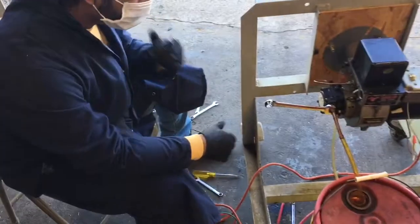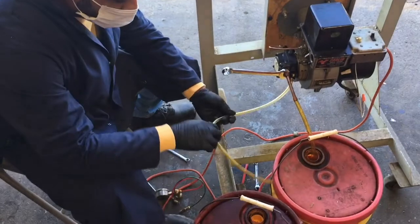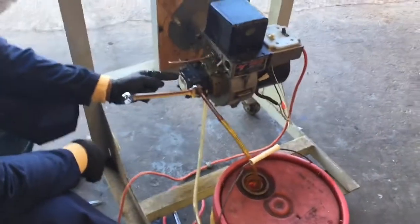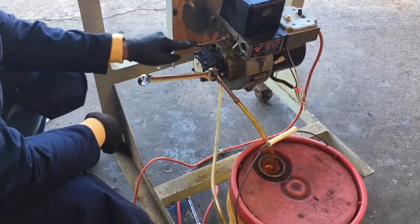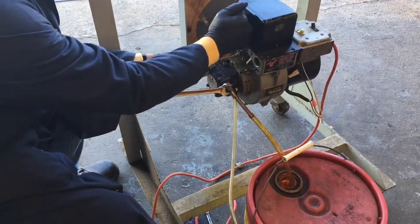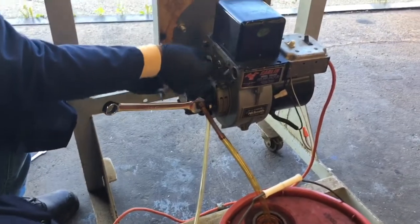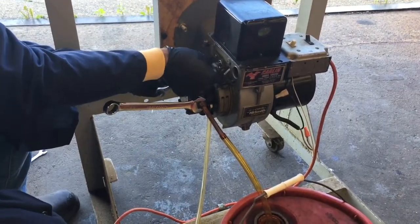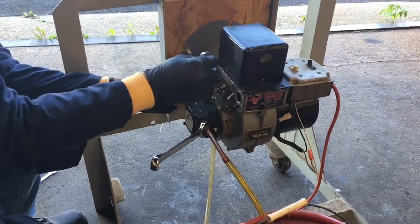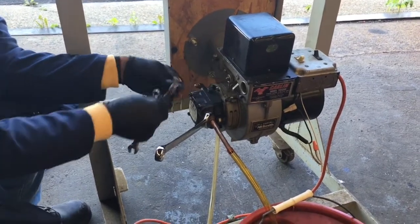What I have here is an oil pump and the oil line is empty. I'm going to show you how to take out the nozzle line. This is called the nozzle line, which is pumping oil at 100 PSI all the way to the nozzle. The first thing I'd like to do is take out the nozzle line. This has to be put in very tight, and when you put it back make sure the flare is correct — it's a flare joint. So take it out and put it aside.